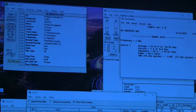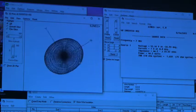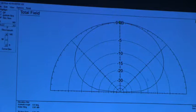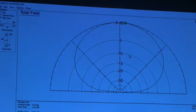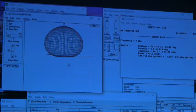So you've got your 40-meter dipole that's up high enough to where you can touch it off the ground. Now, look at the pattern of that sucker. Straight up. It has no pattern whatsoever as far as orientation. It wouldn't make any difference which way you pointed it, northwest, east, south, whatever. At 10 feet, look at the shape, straight up. What's the gain, Gene? 2.7. All right, now watch that 2.7.